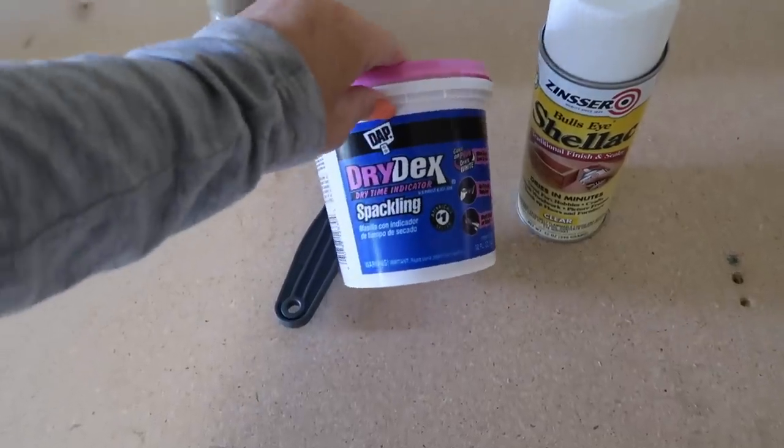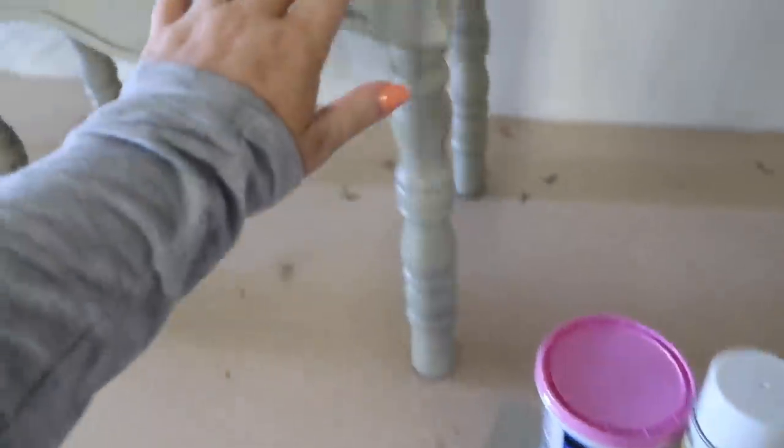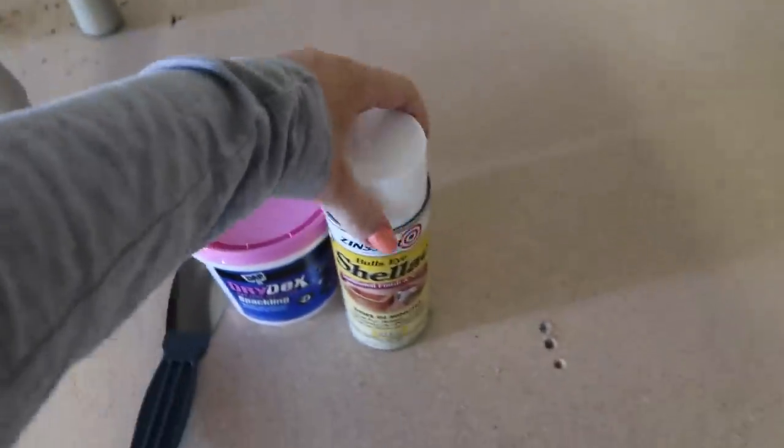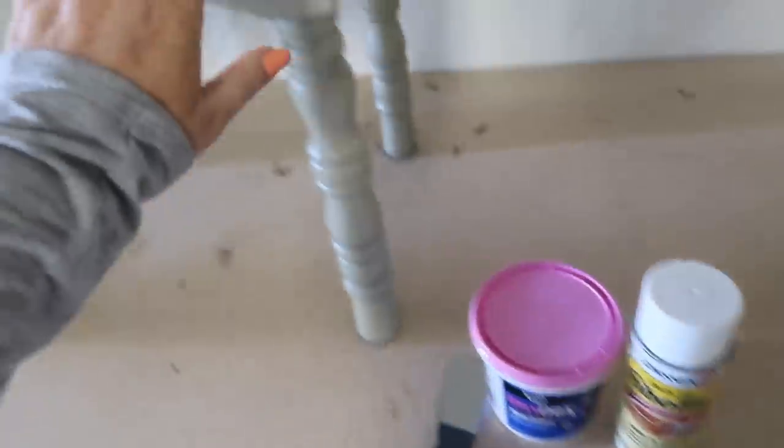Because I'm doing that, I'm going to show you how I'm going to prep this so the paint goes on really smoothly and we don't have to deal with any of the damage from the old holes. I'm just going to remove all of the hardware and then fill it with some spackling. After I do this, I'm going to show you how this comes into play because this is very important when it comes to painting where you have mudded.